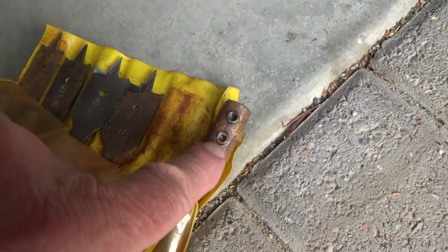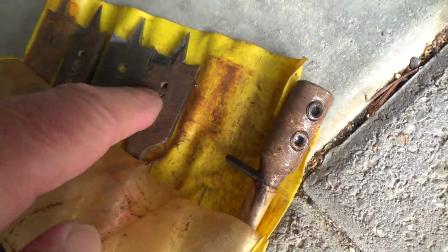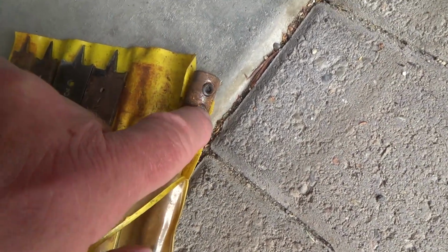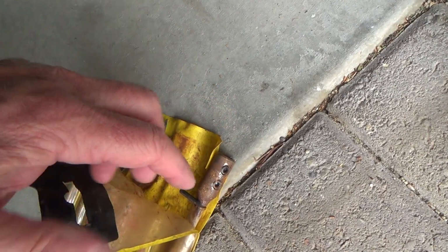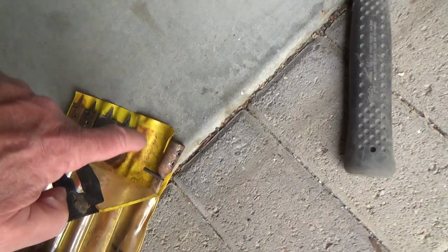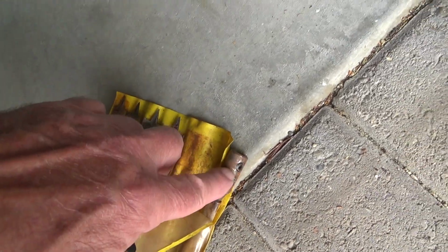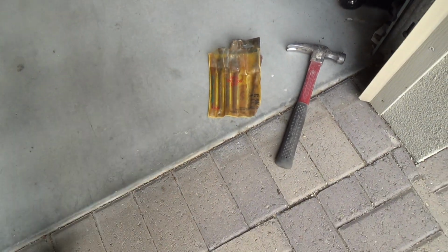And this one happens to have come with an extension piece, which is kind of cool. It came with a little Allen wrench, and then you put this end into this and tighten it up. And you have to make sure that if you ever do that, you tighten both of these and make sure they're nice and tight, because if you drill a hole through the top plate or something, I drilled one once upon a time, not this set, but years ago, and it started chattering, and I thought, okay, it's just the bit going through the wood, but it had loosened just slightly, and I was drilling straight down. After I went through the wood, I heard something go doink, and it was the paddle bit I was using. It fell right out of that, right down inside the wall. It's in somebody's house now, as we speak, 30 years later.